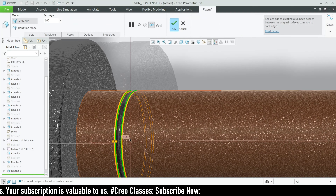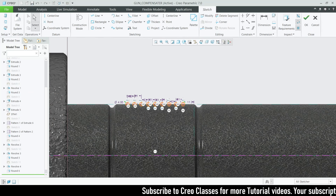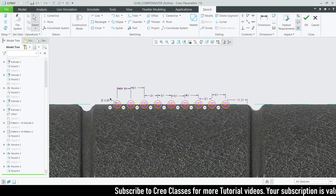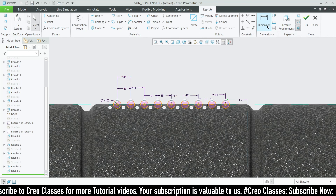Next is a round with a value of 2. Then for the stripes, from this edge at a distance of 80, use a diameter of 6 — these are for my own design. Make those rounds as 2. For another sketch, use diameter of 4, equally spaced 7, with a level of 0.21 from this edge; the same applies on the other side at 11.21. Add a centerline, revolve, and round value of 1 for all these features.